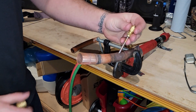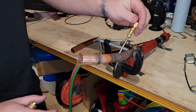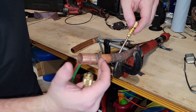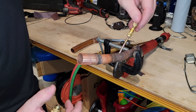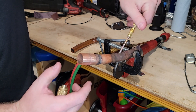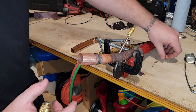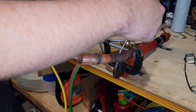You want to go ahead and take your Schrader out — use the cap or a Schrader tool to get that out of there. Because when you send heat here and it flows down the pipe, you are not getting a Schrader out if you melt the plastic. It's just not going to happen. It is way easier with a tool, not with a cap. So now that you have that out, go ahead and hook your hose up.